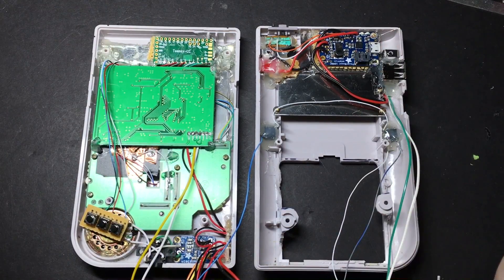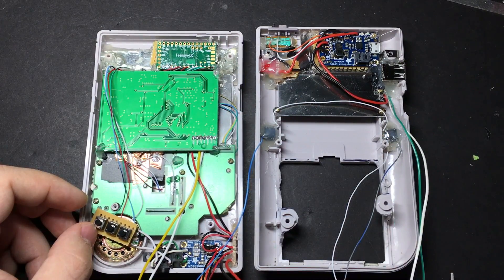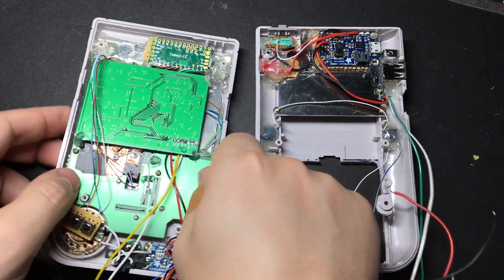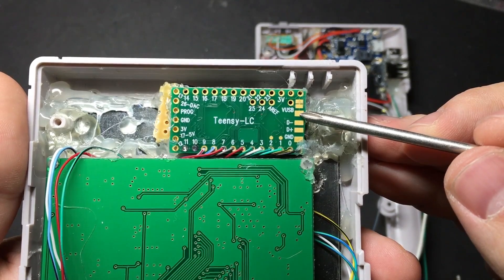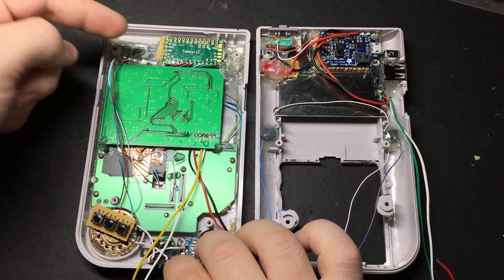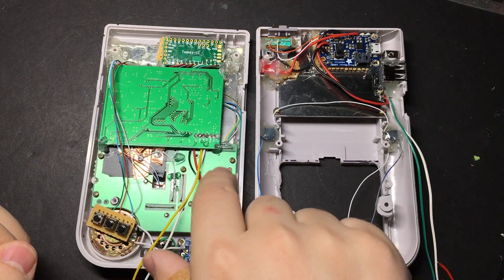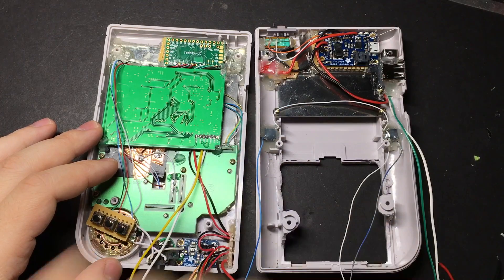At this point we're going to mount the Raspberry Pi and the cartridge reader, but first test out a few things — the Teensy, all your controls, and the screen one more time. Check out part 3 of the guide to see how to wire up the screen. For connecting the Teensy, we'll be connecting wires to the pads on the back to connect it to our USB hub. This one is 5 volts, this will be the white wire, green wire, and this will be ground. You may have noticed I've moved a few things around — I had to scoot the controller board up a little and move the Teensy to make room for the power boost. Just fair warning, you may have to do that as well. Moving anything mounted with hot glue is actually really easy — you can heat it up or slice through it carefully with a fresh X-Acto knife.